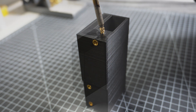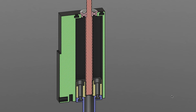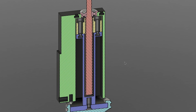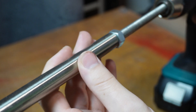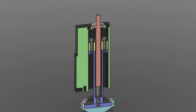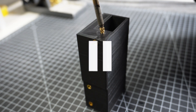A quick break from editing — I feel like I didn't do a good job actually explaining the whole thing. So in this pocket there will sit a rectangular nut. And because the screw is fixed axially and the nut can't rotate, it will move up and down, just like a normal screw and nut. Attached to the nut is a rod that will eventually push the toothpaste out through the nozzle. I hope this quick explanation makes things a bit clearer.